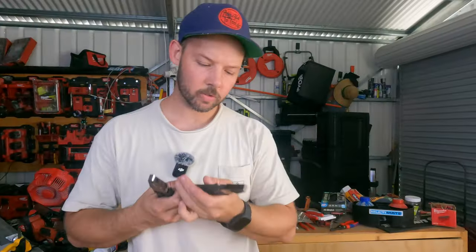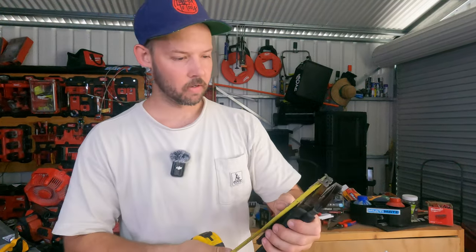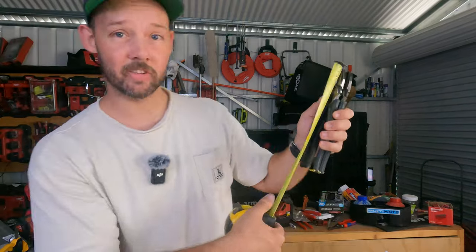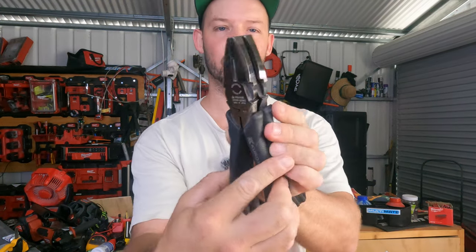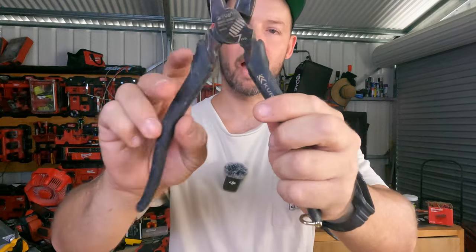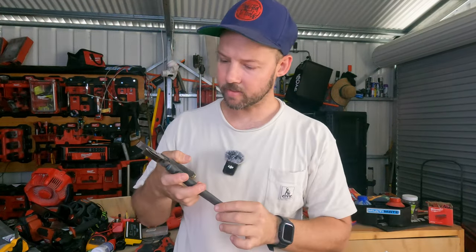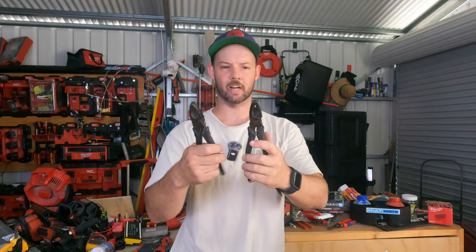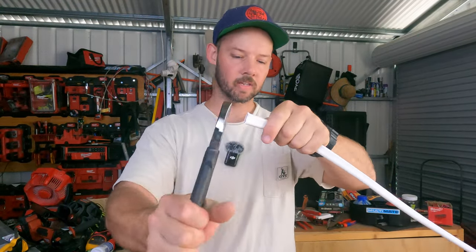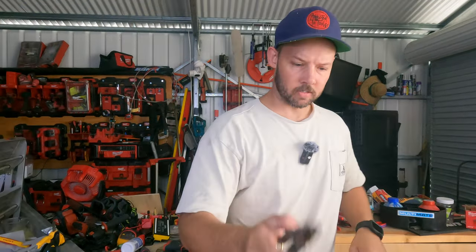The Kurikan 3020N 225 BGS — same 225mm size, measuring around 233mm. These are unique in having a threader built in for cleaning threaded rod. It handles 3/8 thread — it even has it written on the pliers. They feel fantastic. The cut on 6mm isn't quite as good as the other Kurikan pair, possibly because those ones are more used. Still a very nice pair.